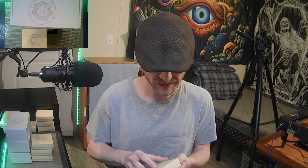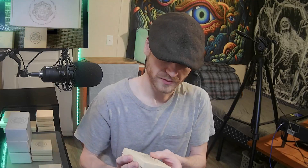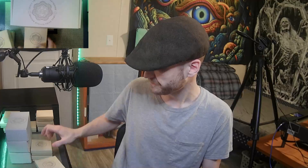We're back and we've had some interesting results. We started using the craft paper setting from our materials library. The power settings and speed were a little off on the first one, so we reduced the speed and increased the power a little bit, and the next one was better. We kept those settings and were able to replicate that. But we noticed we were missing a lot of detail out of this engraving, so we moved on to the next type of box.